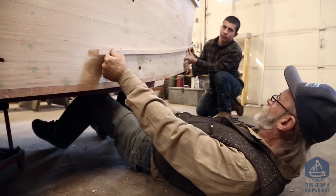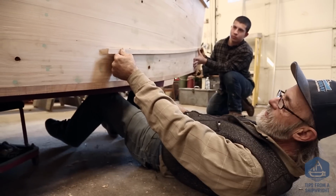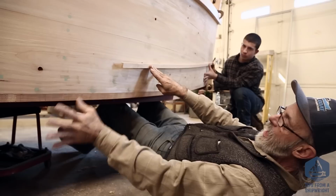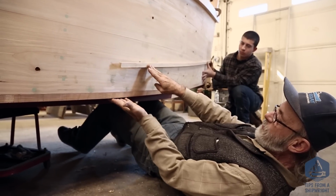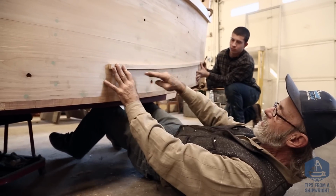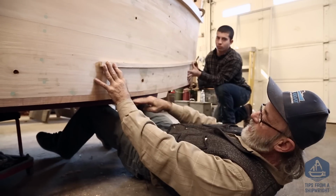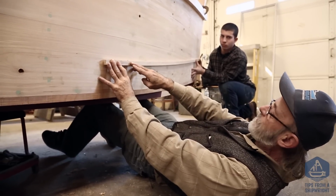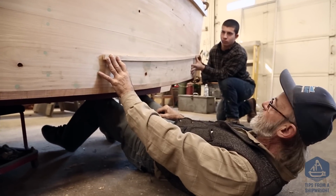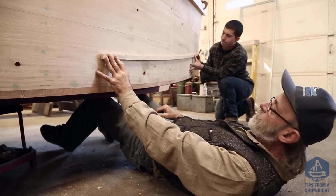So basically what I'm trying to do here is establish where I'd like to put these lift rails. Basically I would like the tail end of them, from here back, to be about 6 inches above the water, because I don't want them to sit in the water when the boat is just sitting still. I'd like them to hover just a little bit above the water, and then I would paint the boat red, the bottom paint up to the lift rail, and from there up, just the topside color, whatever color that might be. So I think 6 inches is the way I used to put them.